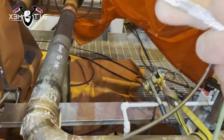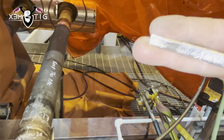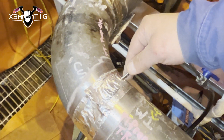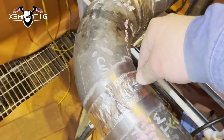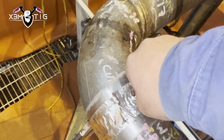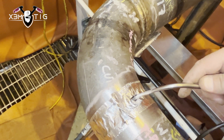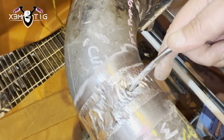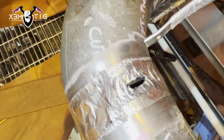I've got one hole open here, but there are up to four holes depending on how much argon you want filled in. I'm going to start with one hole; if it's probably not enough, I'll open a couple more holes on the needle purge. The needle is poked in at the top and I'm going to start welding from the bottom.